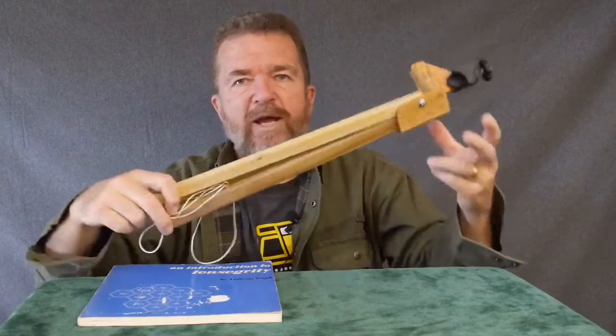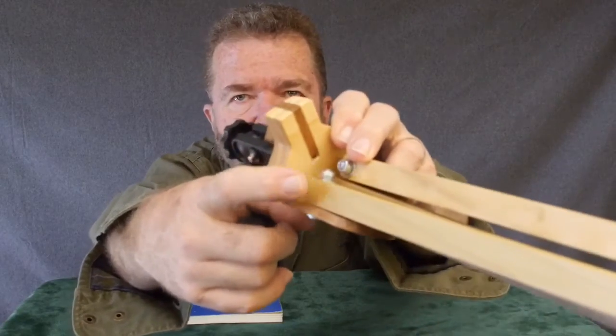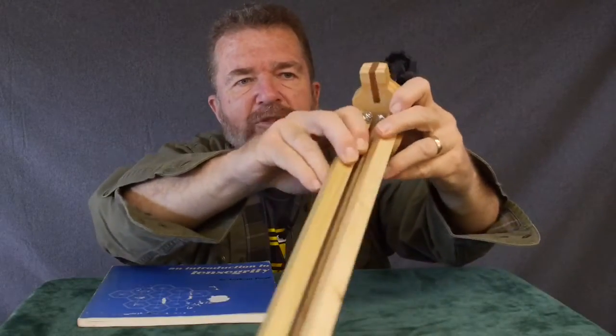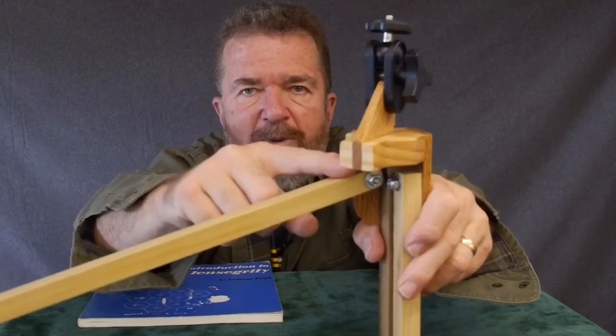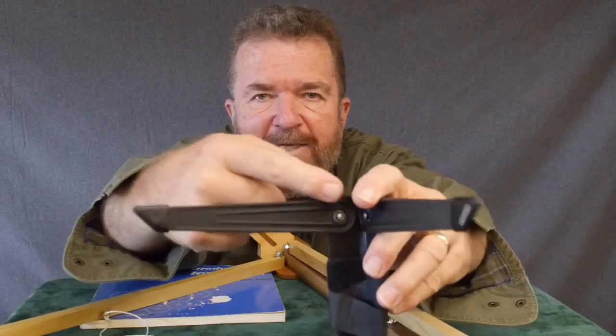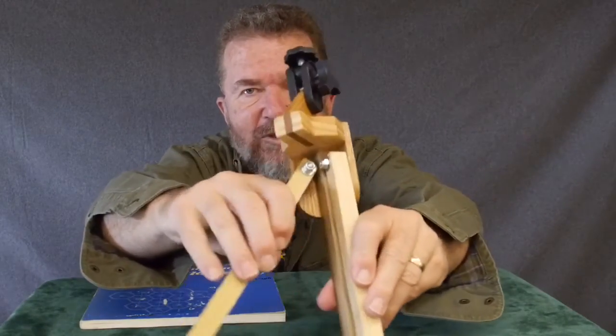That was the first problem I solved. The second problem was locking the legs. The leg joints use nylon nylock locking nuts to connect the legs to the 90-degree bracket. With the way I had built this, the hinge point for the secondary legs had no real stopping point at 90 degrees like the UltraPod, where a bracket stops the leg at a perfect angle. I didn't have the luxury of easily doing that with this design, so I ended up employing a method I had used in my two previous tripods: a loop of string. It looks kind of funny and hokey, but it works really well.